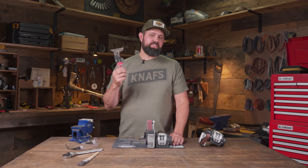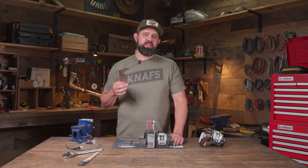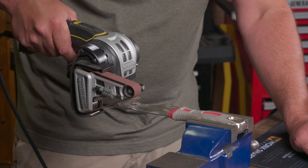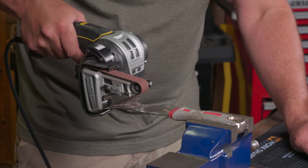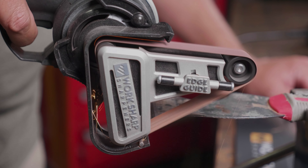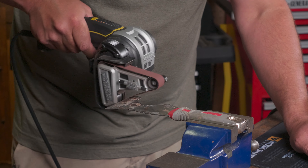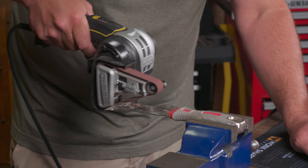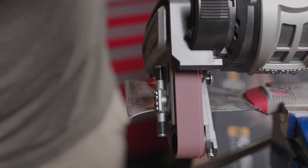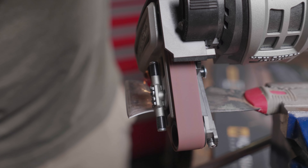Next up we've got this five-in-one painter's tool — similar to a putty knife. It doesn't necessarily need to be super sharp but a clean edge is appreciated. With the tool mounted up I'm going to bring the grinder to the tool. This is pretty thin metal so I'm going to use a lower speed — set it at five — and make a few passes; this should clean up pretty quick. Now that I've got that edge cleaned up I'm also going to hit that curved edge as well. One of the advantages these flexible belts give you is the ability to follow the curvature of those edges.